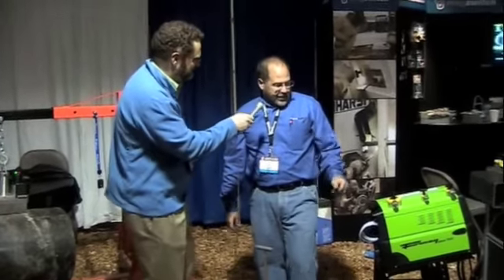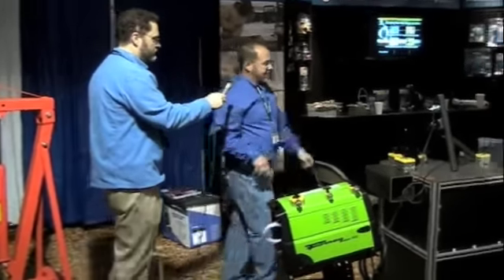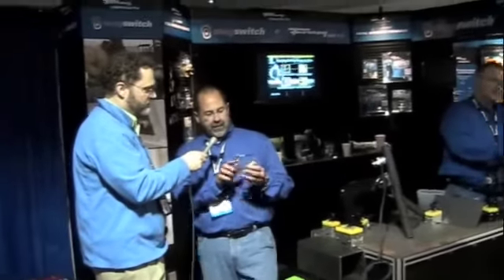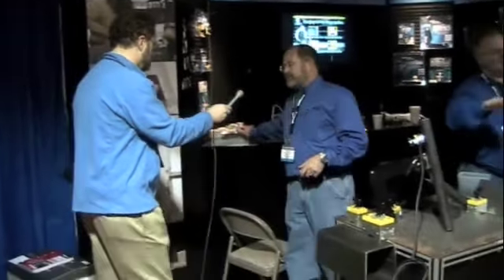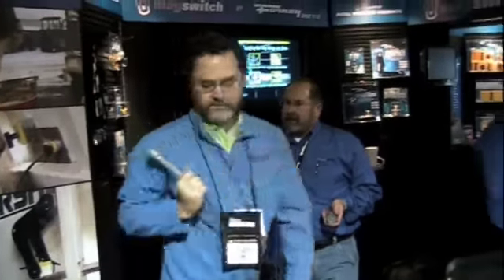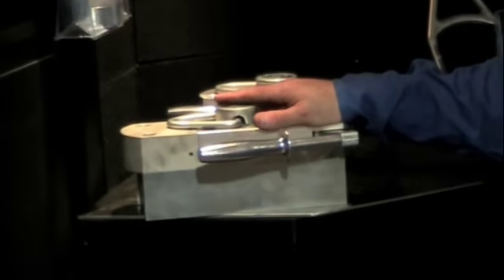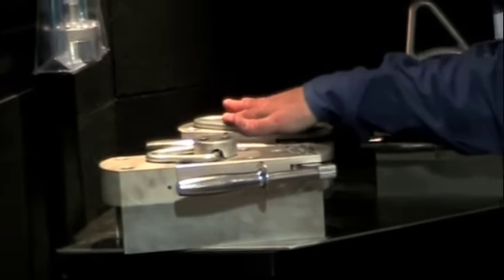We also have hooks — very handy devices for safety. A couple different sizes, such as this little 30-millimeter version, with a bigger brother as well. You just put the hook on the side of a piece of metal when you're working to hold your lights, lines, hoses, meters, and equipment. Makes it much easier when you're working by yourself. It even holds small nuts, bolts, and parts on the sides of the magnet. And heavy lifters — this family back here, this one is about 3,000 pounds of breakaway. Very lightweight, very compact, and also exceptionally efficient on thinner metals. That's something very difficult for magnets to do — hold very powerfully on thin metals. We're the most effective in the world on thinner metals as well.